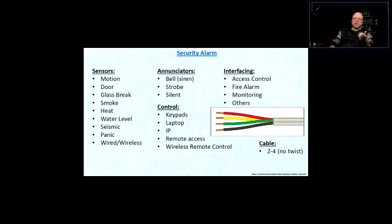But sometimes when you're inside, you want something called a stay arm, which would be programmed into a stay arm condition. You would include some of the zones, like the inside motion sensors, into the stay arm zones. So when the system is put into stay arm instead of fully armed, the outside perimeter could be armed, but the inside motion sensors not armed. In the middle of the night, if you go to the fridge to get a glass of milk, you're not triggering the alarm. But if somebody's trying to get in from outside, they're going to trigger the alarm. That's called the stay arm. So remote controls are quite popular: you can go to bed, click, arm the whole system, go to sleep, and just remember to disarm it before you leave the house.